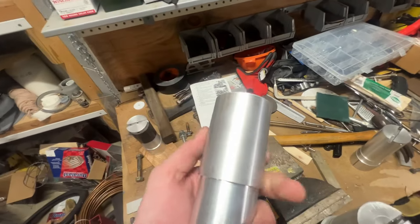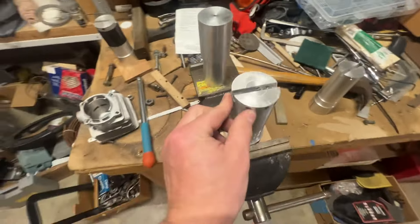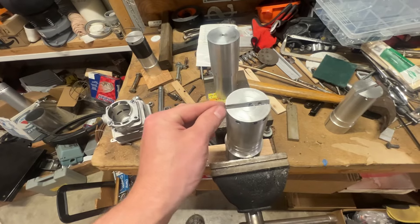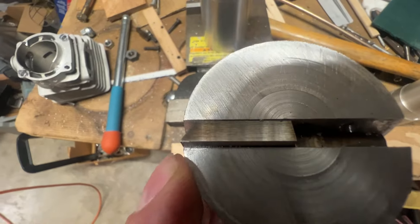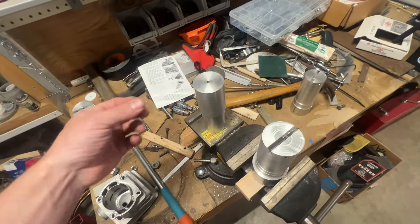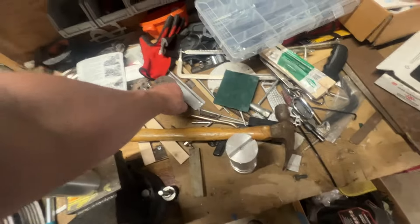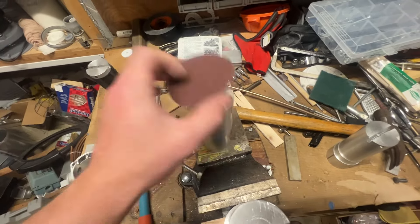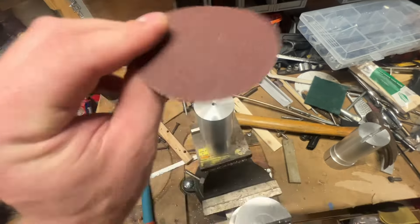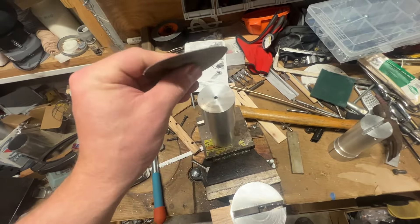For sanding I'll use the same mandrel I used to cut the cylinder base — one that's a lot closer in size. This one's slightly undersized so I can move the cutter a little farther out to reach just beyond the edge of the combustion chamber with no clearance issues. Once the motor rotates over, you know you're getting close. I'll put a piece of sandpaper — I like using sandpaper with a woven back so it doesn't rip. It can be like a belt sander belt; this one's actually a disc sander type, but it needs to be a woven-back sandpaper — it's a lot more durable.